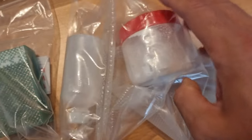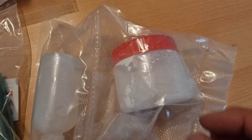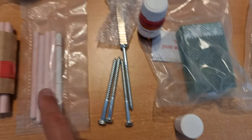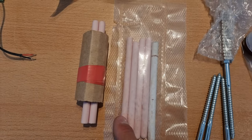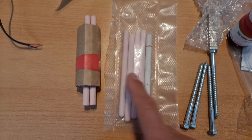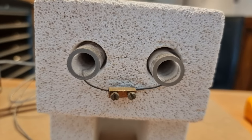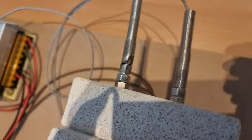Once those are in there, there is some alumina Parkhomov-type sodium silicate and alumina-type cement that is used to seal up the tube. Then around that, when the copper is on there — which Lion originally used as a copper winding around the outside wound up and down — he did that to allow some thermal contact between the inner tube and the actual fused quartz tubes, where the Kanthal wire provides the heating.